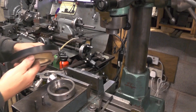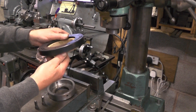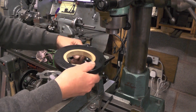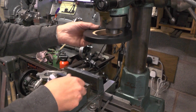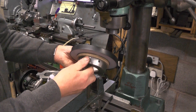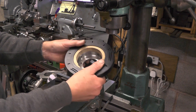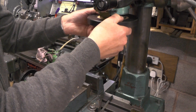This intermediate adapter fits into the light, and then that's going to fit onto the milling head of my milling spindle. I'll bring the wire up the back and through the body of the miller. Then this grinding attachment that I've made fits onto this — it's just a tight push fit — and then this is going to fit onto my milling head like so.